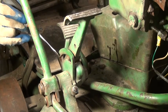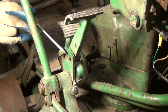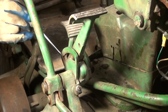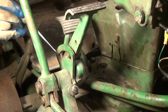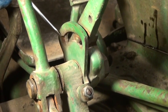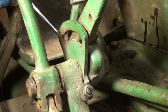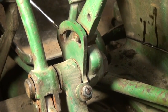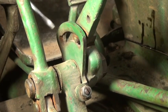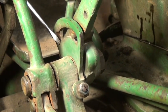So you really relied on the brake adjustment, and it was perhaps a little more crucial. This design allowed for a positive brake lock so that it positively engaged the lock on the brakes, so everything should be good. Now, since we've adjusted our power shaft clutch by the book and put it in, we're going to say it was supposed to be in the ballpark. So the next step is we need to adjust the quadrant that this little peg on the pedal travels through.